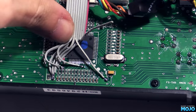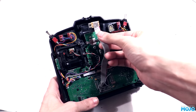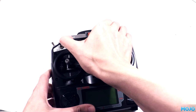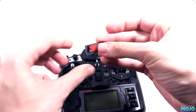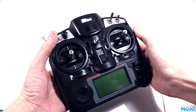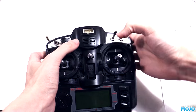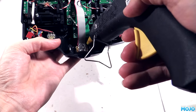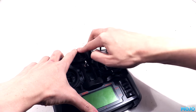Next we need to mount up the connector. I got an idea for mounting it up behind the logo from an article I found - if I come across it I'll stick a link in the description. The Flysky logo is easy to peel off - get a knife under one edge and work your way across. It leaves us with a nice spot for the connector. We can draw around the socket giving us a rough shape for the hole, then a quick buzz with the Dremel and we've got somewhere for the connector, which can just slot in being nice and level with the case. To hold it in, squirt in some hot glue - a good blob at the top and two blobs in the bottom corners, being careful not to let any glue get to the pins. Once it's cooled down, pop the logo back on and no one would be any the wiser it's been modded.